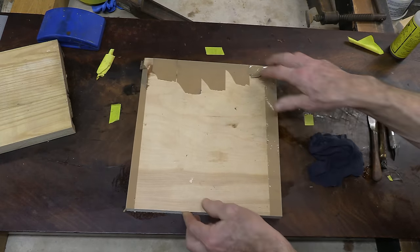I feel like I've done a good job of sanding with 150, but before I go any further, I want to prepare the edges. I've got some repairs to do and a little bit of sanding. That chip I'll piece some veneer in. Small chip like that, I'll use epoxy putty. Even this corner, it's so rounded over that I'm just going to use a little epoxy putty to level it off a bit, because I'm going to keep it rounded over. There's no point in trying to rebuild a perfect corner there. It's gone.